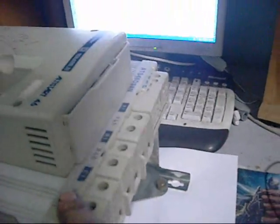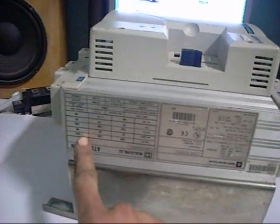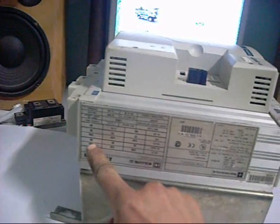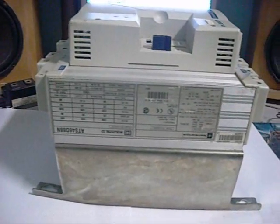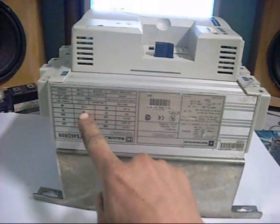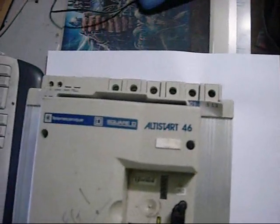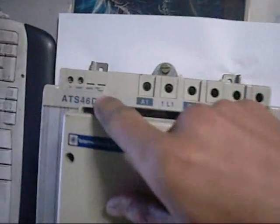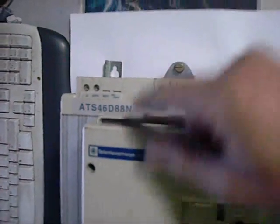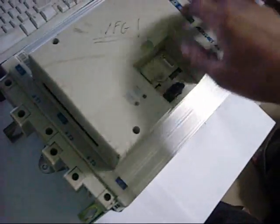It's for three-phase motors. I think it's rated about 30kW — the model number says 460 volts, rated at 60 horsepower, 55kW. And at 400 volts, 45kW. Pretty good stuff. Made by Telemechanique Square D — obviously the two companies are combined now. It's the Altistart 46 ATS 46D88N. I looked this up briefly on Google — apparently it has 6 thyristors inside it.